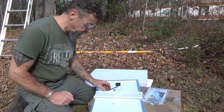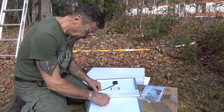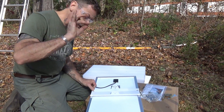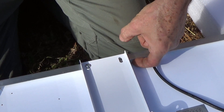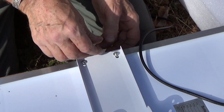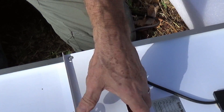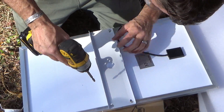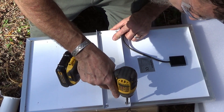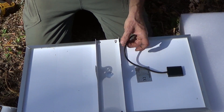For the solar panel, what you want to do is go in the middle holes right here. There's four holes — you want to go in the middle. You put this little lock nut underneath the hole like that, and then you center it and put your little tiny screw right in there. I'll tighten it a little bit more now that I got them all in. That's one.